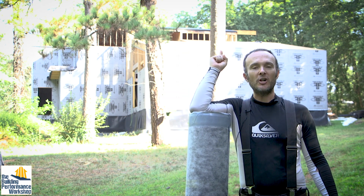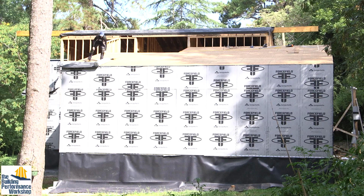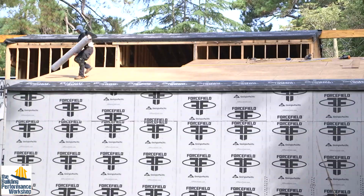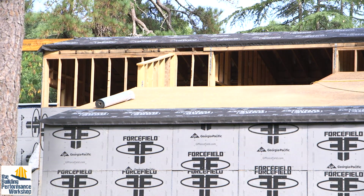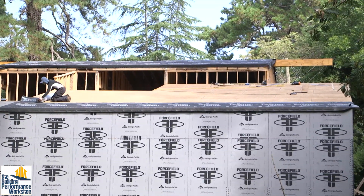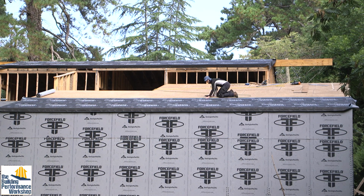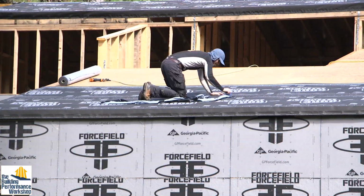You can see it installed in the top part of the top floor roof already. This is what I'm talking about. It's called Solitex Mento. It's a roof underlayment, which means it's watertight, but it's vapor permeable, which means it lets whatever is behind it dry. And it's also airtight. Substantially airtight. We learned in home chem that nothing in a house is truly airtight according to the way the chemists look at things, but that's okay because we're trying to just hit blower door numbers with this.